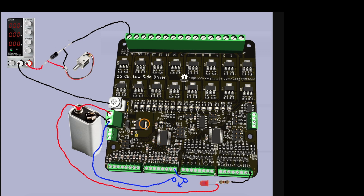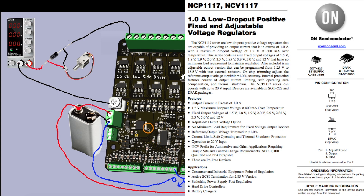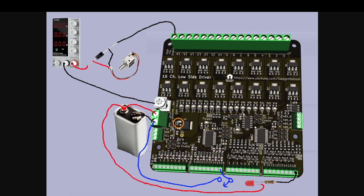The board logic runs at 5 volts with an onboard regulator. To power the board with flexibility, I wanted to support a variety of DC sources including wall adapters or other power supplies, so I rated the input between 6.5 to 12 volts. Dropping from up to 12 volts down to 5 volts will cause power dissipation, so I'm using a surface mount package that can easily handle that dissipation including the current to run everything on the board.